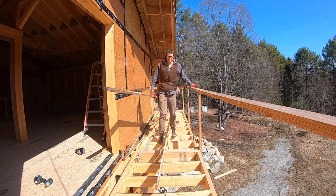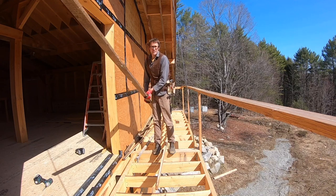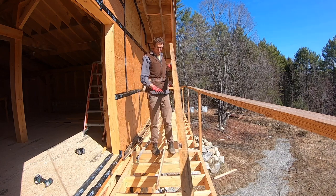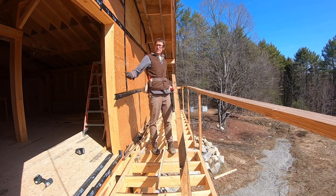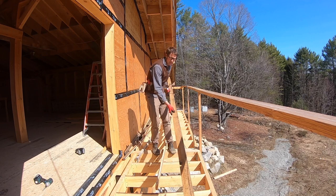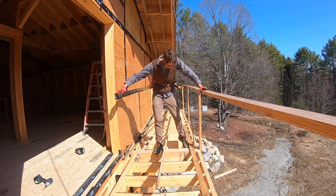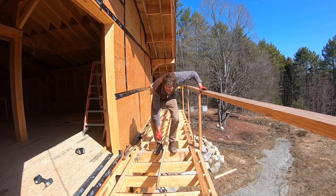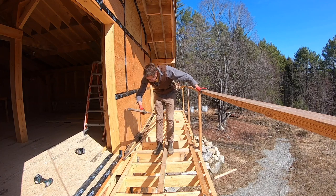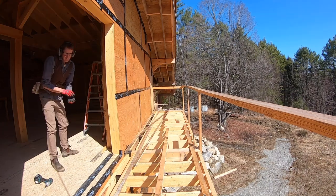So the idea here is with this strapping, I'm going to lay it down on top of these deck joists, and then put the plywood on top of that for the summer, or half the summer, or whatever, to let this green wood dry out at the same rate, with airflow and circulation. So that's what I'm up to. And it can be kind of fast and loose. Pattern doesn't need to make a ton of sense, just needs to span. Span it will.